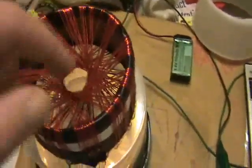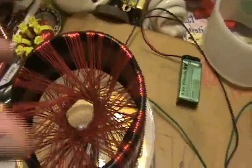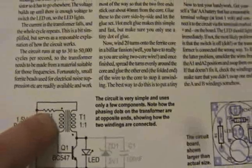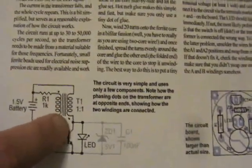This is a one-to-one transformer, but with the transformer hooked up out of phase — you can see these dots here, they're out of phase. We have a spin in one direction and a spin in another direction, and they're sort of interacting with each other. With the scope probes I'm going to look at both signals: channel 1 is the 1k ohm dot and channel 2 is the signal on the collector of the transistor.